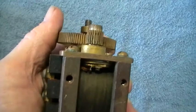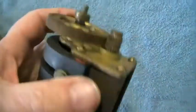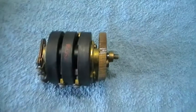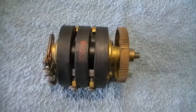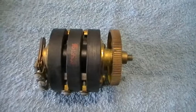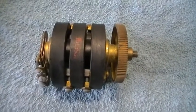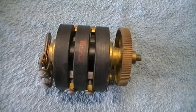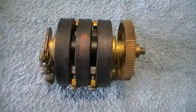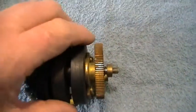This is a magneto used for ringing phone bells. Old-fashioned phones had a handle on the side — you'd turn it and that would ring the bell at the other end, or at the telephone exchange, so the operator would know someone was calling. It sends out about 25 cycles AC, just enough to ring an AC bell. The speech circuit is DC, but the ringing circuit is AC.